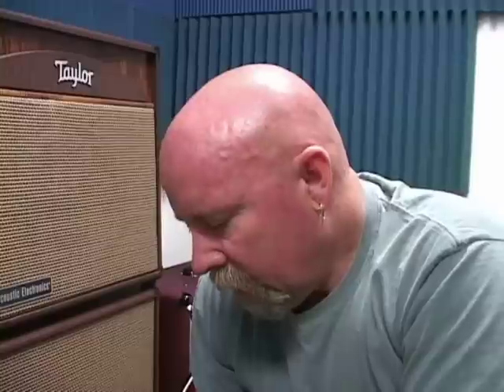The ground conflict, or ground loop, is no longer with us. It's a simple thing to do, but it's important to realize you can make your system quieter by having a good ground and by not having ground conflicts. Now, the last thing to remember: if you go back to using an individual amp, don't use it with the ground lifter on it. You want good ground on an amplifier for safety and for collecting audio noise. That's a little primer on ground loops and how they occur in a real-life setting.